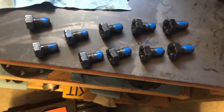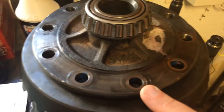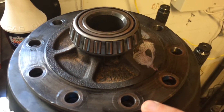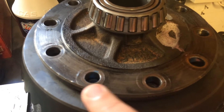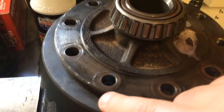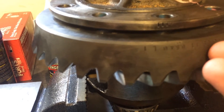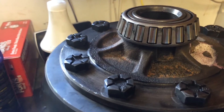The bolts are ready. I'm going to take each bolt and put it into one of the holes — we have 10 holes, 10 bolts. Then with a wrench I'll start to torque it down. The way you do this is never clockwise or counterclockwise in order — you always do one bolt and then jump to the opposite side.